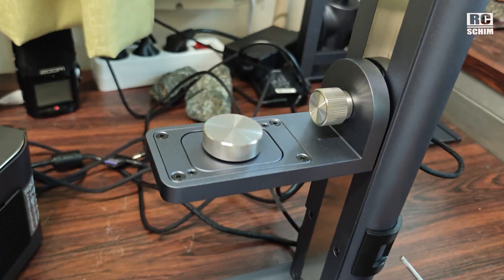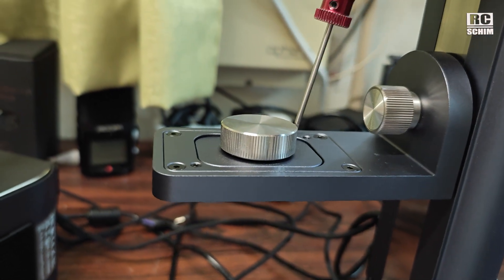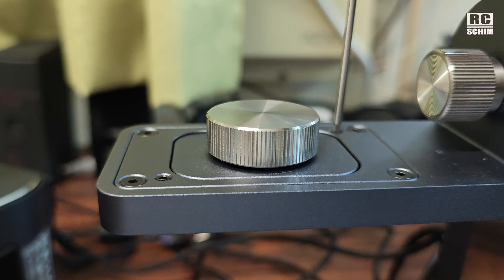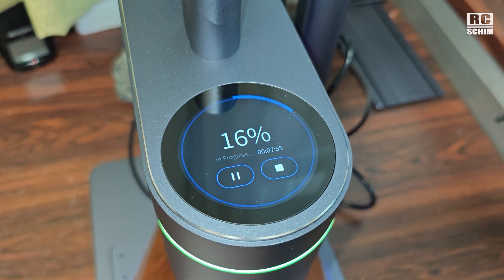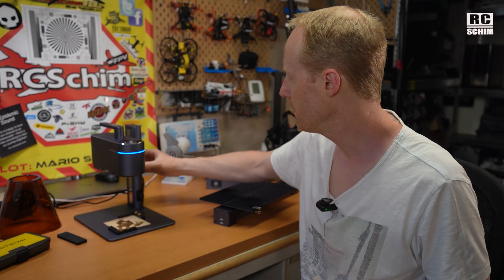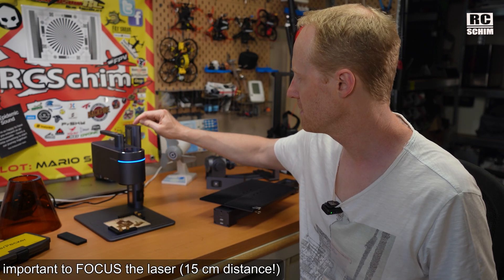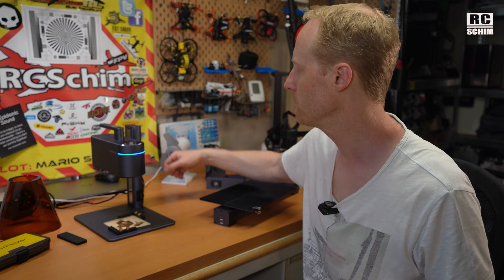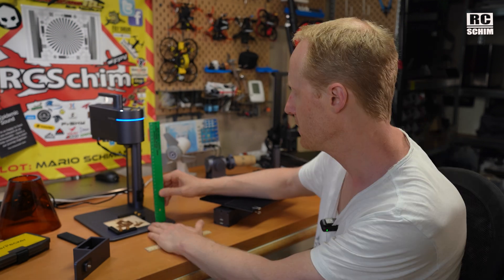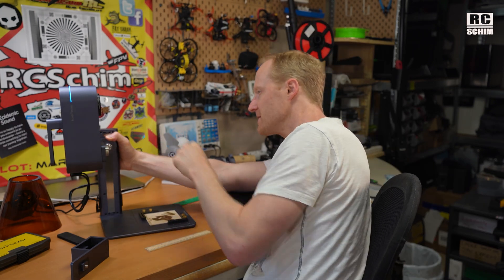I'll give you a quick overview of the components I got. This is the pro set. There are many nice little features — screws in place, the laser head. The mount can be tilted by set screws and has springs to move slightly up and down. It's got a round display with a progress bar and percentage. You can press a button to stop the laser. On the vertical axis there's a stepper motor to move it up and down — single steps or long press to keep it moving.